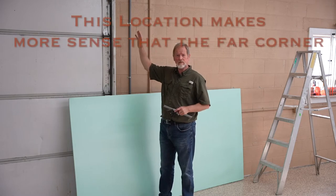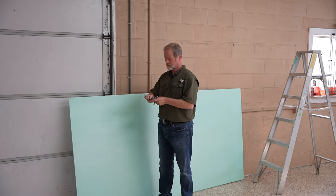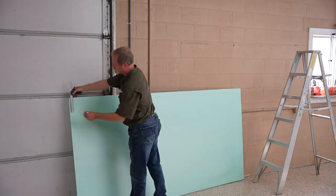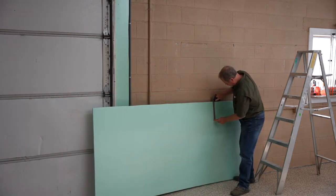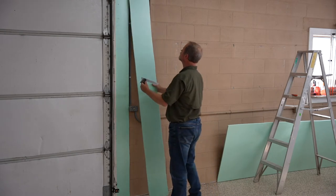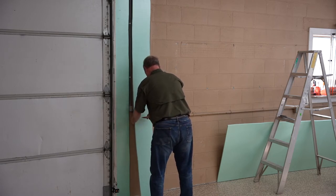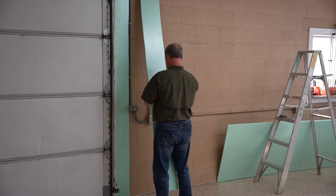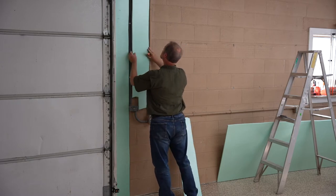If you put your board up there and apply a little pressure, you can get an indentation on this stuff — it's pretty soft. That will tell you where you need to cut. I took this board, pushed it up against my light switch, and I got about seven and a half inches. I'm going to take my rule, mark it, then come back with a box cutter and trim that out. I've got the first piece in, and I'm going straight to the knife with my combination square. A good cut allows you to break it off pretty simply. Now we've got to fit our piece in between the conduits and clear the plug. I'm not looking for a perfect fit — just looking to get the green board up and give myself a bit of a vapor barrier.